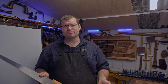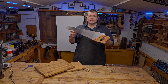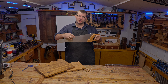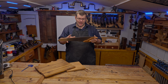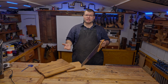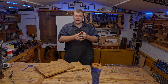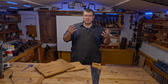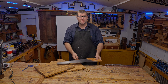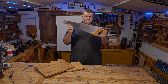That's how you do a quick resharpening without worrying too much about the angles — just go off what the saw already has, and you can see it works well even if you don't match the angle 100%. It's a fairly quick process and more forgiving than sharpening a rip saw. If you like this video, please like and subscribe. Leave any questions about crosscut sharpening in the comments, and check out the linked video on saw set, which is another factor that affects how well your saw operates.